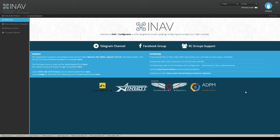Okay, we're here with INav. I'm going to try to burn through this as fast as I possibly can here, guys, but still get the relevant information for you. The first thing I would do is get yourself a 6-foot USB cable. The reason why is because your magnetometer or your compass is so sensitive that it'll even pick up the speakers of your laptop or your computer and your monitor and so on and so forth. Anything that has an EMF, electromagnetic field, or even metal around you. I mean, it's that sensitive.